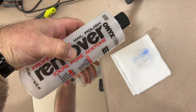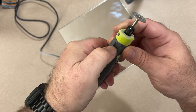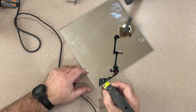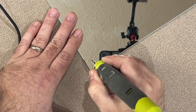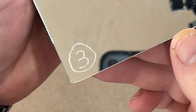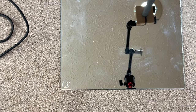I have seven printers so I number the corners of each plate so I know what printer it goes to. That way if I take multiple build plates off to clean them, I get each plate back to the printer it came off of when the bed was leveled, because I do manual bed leveling. I use stiffer springs and I don't have to touch my beds ordinarily unless I change something like a hot end, nozzle, or wheel adjustment. So I engrave the number three in the bottom left corner of this plate with a circle around it — that's how I identify which machine it goes to.